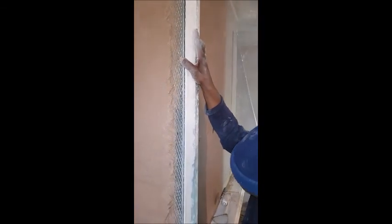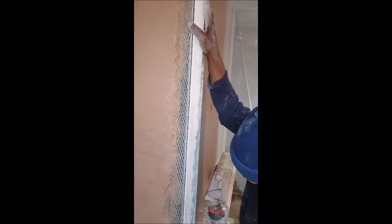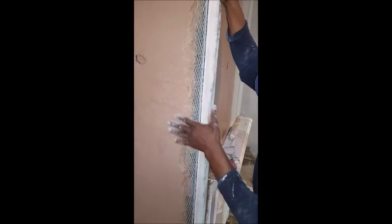That side there. Once that is set solid, like how that is there, it would replace the straight edge again around this side, right? Assuming that our bead is still bent, yeah? And then you would plaster to the edge of the straight edge here. Now, what would happen after you finish the bonding, getting ready for the finish? This edge here would be made of plaster, and that could break very easily. So if somebody comes and hits it with something, you'd have a dent in the edge.